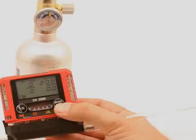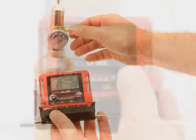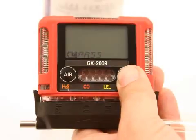Press and release the power mode button. The LCD will display the current gas readings and auto-cal will flash. Turn the regulator on-off knob counterclockwise to open it. Calibration gas will begin to flow. Allow the gas to flow for two minutes. Press and release the power button. The GX2009 will attempt to make a span adjustment on all channels. If the span adjustment is successful, the LCD will display pass on the screen before returning to the auto-cal screen. If the span adjustment fails, the LCD will show fail on the screen indicating which channel or channels failed. The alarm LEDs will flash and the buzzer will sound a double pulsing tone.